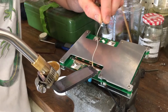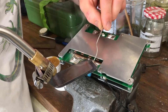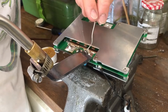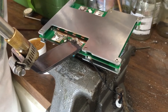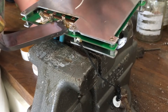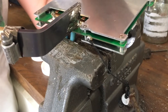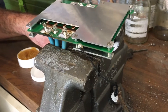First step here is I'm just trying to get the flux to melt and flow into the wire, and then when I touch the solder it starts flowing into the wire really nicely. Now I bring the tool down to the solder pad and add a nice thick pool of solder. That'll do.